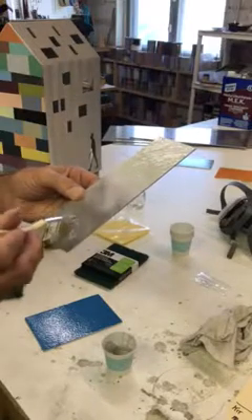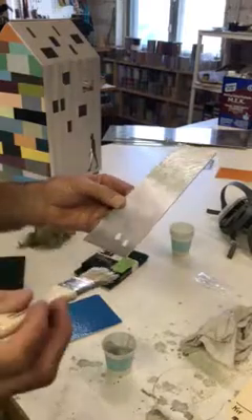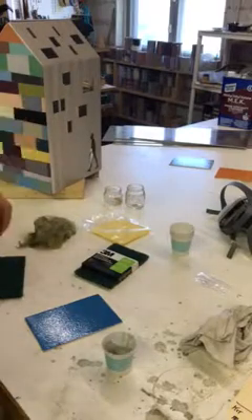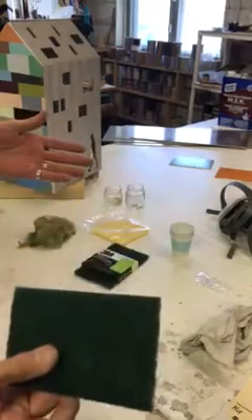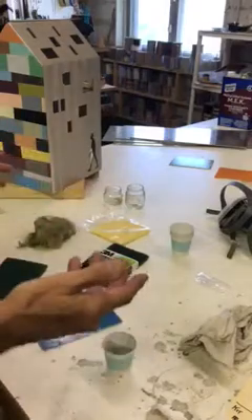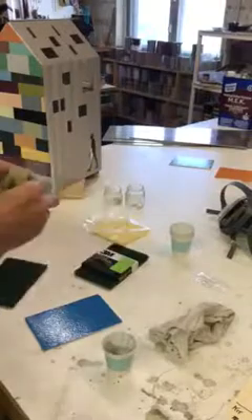If you are just touching up any nicks, use the corner of the brush and subtly touch up where the metal is showing on those chipped or nicked parts of the finish. You should cover the exposed metal and overlap the adjoining paint just a little bit. Let that dry overnight. You can lightly buff the primer again the next day if you choose, then dust it with the tack cloth once again.